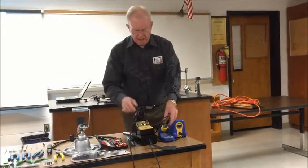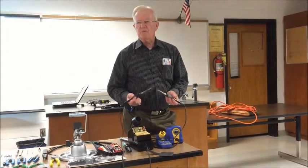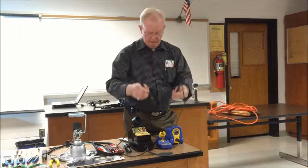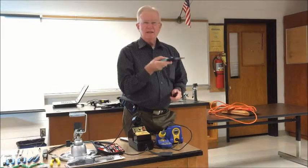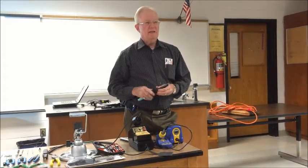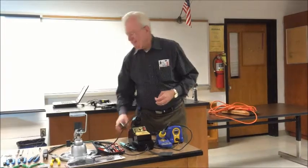Is this adequate heat? Well, for putting wires together, yes. For soldering terminals, yes. But I'll tell you what, guys, you're not going to do a PL259 with these. No way. You're going to need some beef. That's what you're going to need. I think I demoed to everybody last year or a couple of years ago how to put on a PL259. And all things considered, crimp. Crimp when you can.